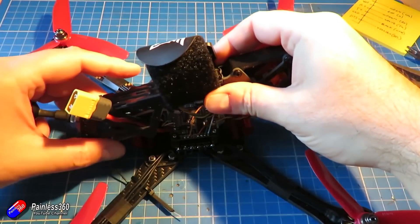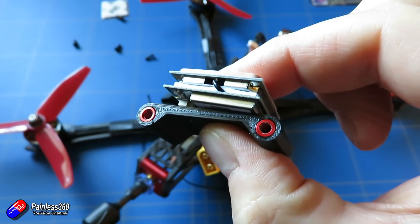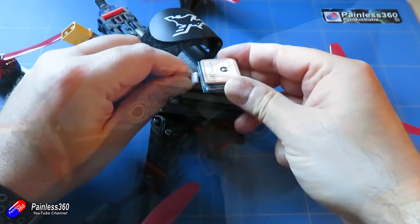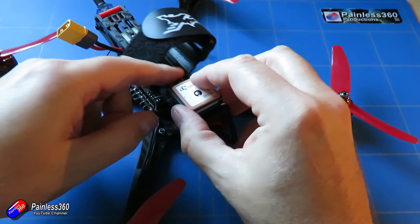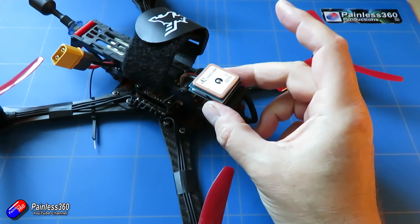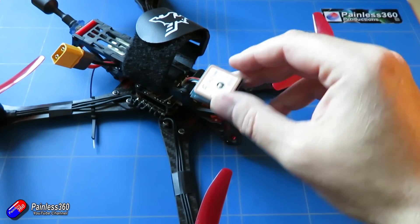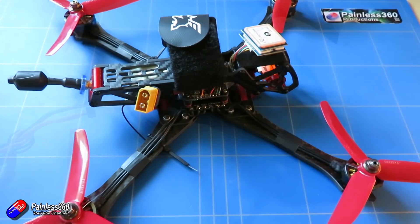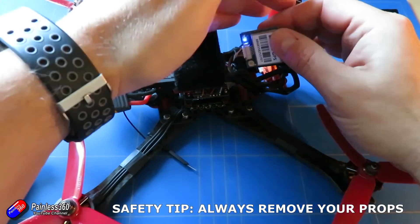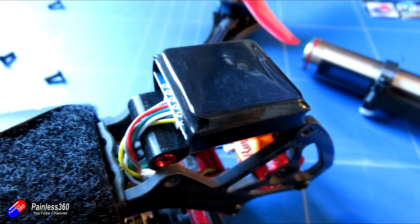With all connections made I can put everything back together and install the GPS. This 3D printed bracket on top — I'll make it available on Thingiverse so if you want to download it for your Skull 3 frame you can. Just be really careful about where you place the compass. There are reports of some cameras, like the Tarsier and other dual-lens HD cameras, putting out quite a lot of RF noise which can affect the compass. As I'm only using a standard RunCam underneath it should be fine, but if not we may have to add some shielding. I'll pop the compass on top, secure it with the double-sided tape it came with, then put some heat shrink over the top and secure it in place.